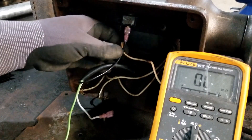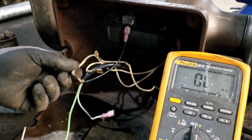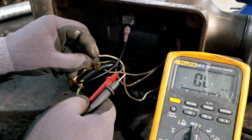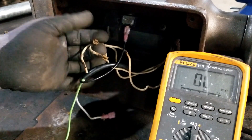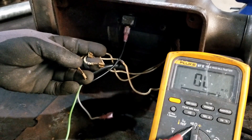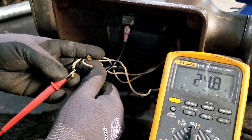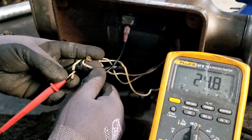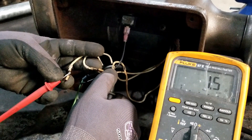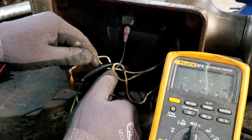This motor has three wire leads coming off — some of them are labeled. There's an 8 on that one, a 1 on that one, and this one doesn't have any number. To test this, since there are three leads, put your meter on resistance and touch two leads — you get 24.8 ohms. Then move one of the leads to the third one and you get 1.5 ohms. Then one more test — move your other lead back.